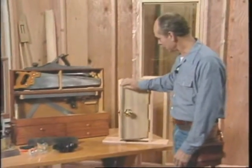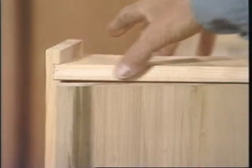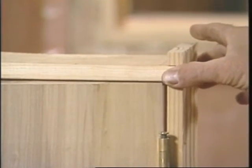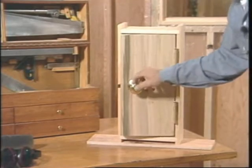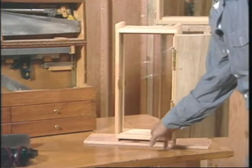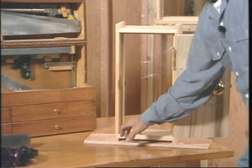This is a piece of poplar that I've turned into a model of an interior door. This is the interior jamb set, and it's dadoed into the sides, a lot like the window frame we did earlier. This piece on the bottom wouldn't be on a real door, but I've put it on here to hold this frame rigid. On the real door, I'll replace this with a spreader that'll hold the jamb sides apart.